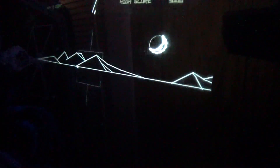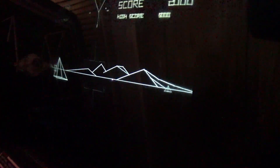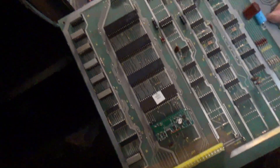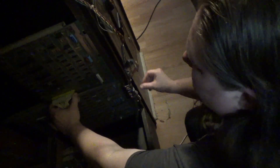Just for giggles, let's put that Pokey One back in just to confirm since I have doubts that it works. We now have a Pokey One - the Pokey One prototype. See, that is our known good working Battlezone board - the analog generator. And down here is another board that is almost working. Let's see if we got sound out of the Pokey One - yep, we do.